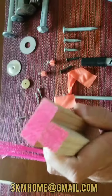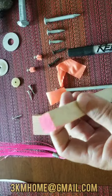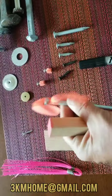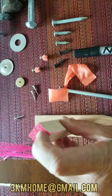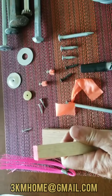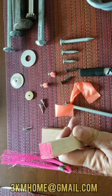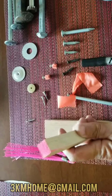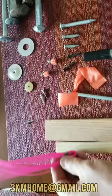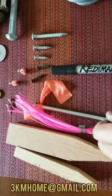There are other smaller hubs — about half the size. We call these 'guineas.' We've seen a lot of people now use these like 60D nails: they'll set them and use a marker to put a little X where the point actually lies. Remember, if we're doing a bunch of staking, these are just temporary points — so an X, a punch, or a cup tack is fine. These are being used a lot to take the place of hubs. Both of these, if you want, you can use feathers so you can find them later, and the feathers also work with 60D nails.